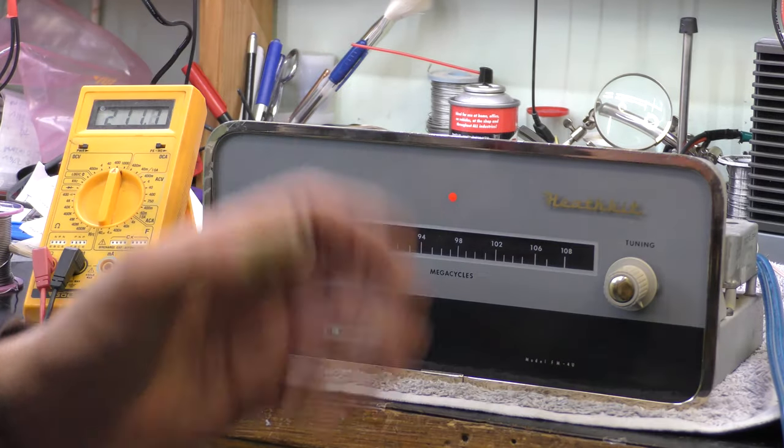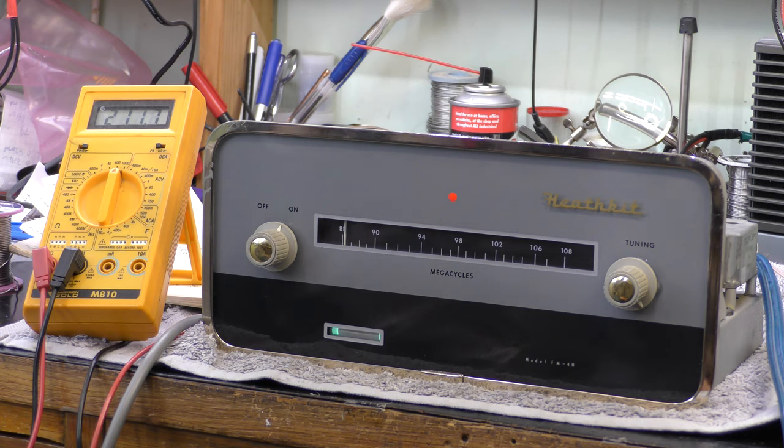Right, well, that's very interesting, going round in circles. Resoldered the valve socket, checked the heater again, still continuity, or appeared to be. So I've ended up substituting another EF80, and that is heating up fine. I wonder if the filament's got a break in it. But anyway...